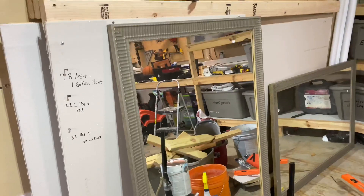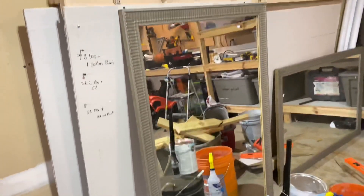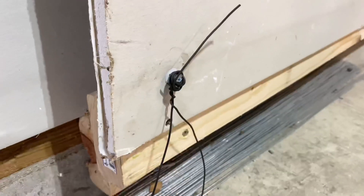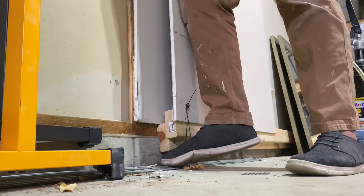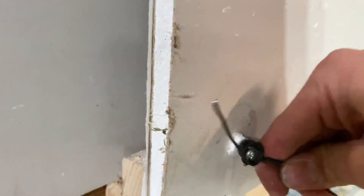For some comparison, this mirror actually came in at 31.6 pounds. More experiments coming soon — I put in a 75-pound anchor towards the bottom and actually stood on it and it kind of held. I'll do a proper 75-pound max test in the next video, and I'll also try a toggle bolt which claims to be 375 pounds.